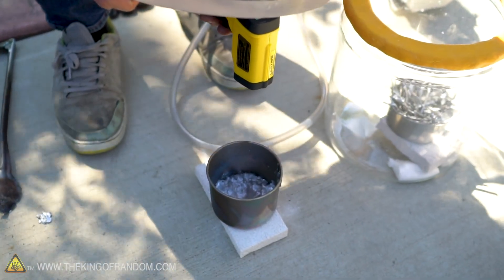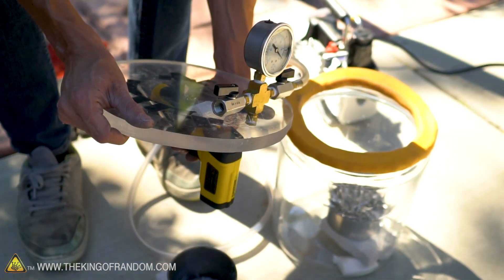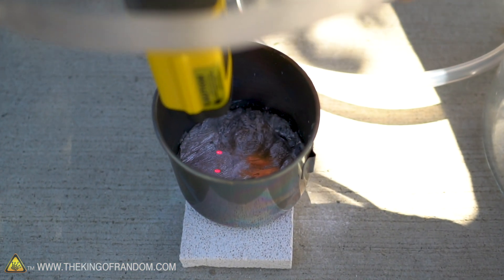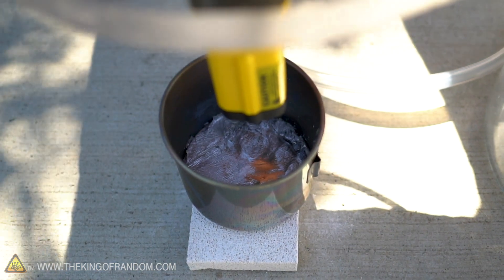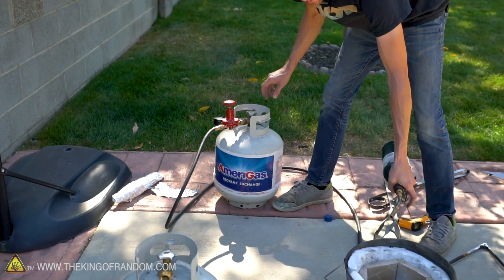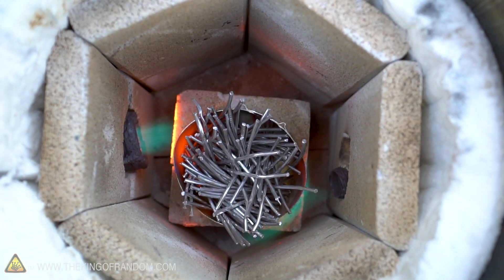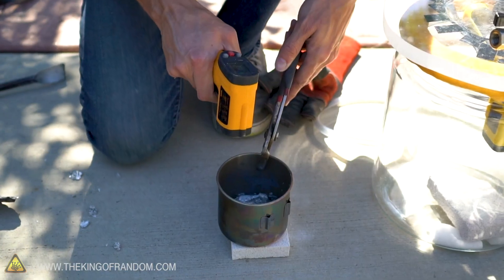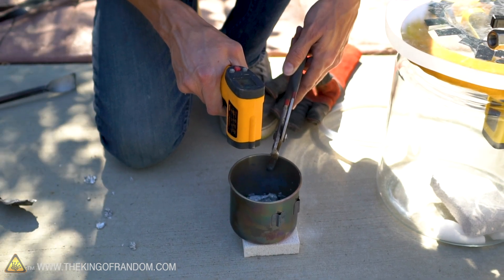The thermometer, which is still attached to this lid, is only showing a temperature of about 500 degrees Fahrenheit — a little bit more depending on the angle. I think it's probably kind of hard to read aluminum, which is very shiny in places, and it might struggle with that. Aluminum isn't liquid at 500 Fahrenheit, so that's probably not a perfect representation, but it will give us a comparison between the two. The aluminum is definitely cooling down — it's now at that stage that's weirdly clay-like. I can stab into it with a little bit of pressure, but it's definitely not liquid.